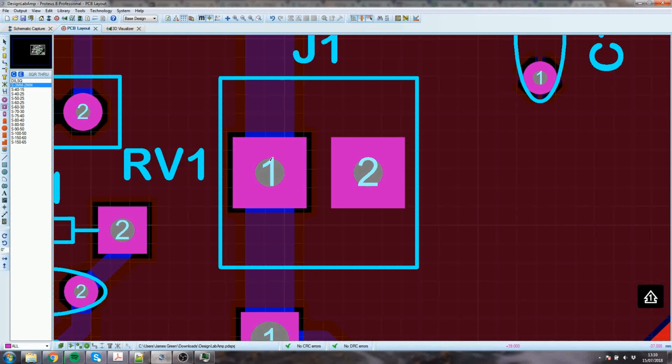When you get the board made, the through hole will be plated, and if you have to drill out that hole a bit to make it bigger, you have to be careful not to destroy all the through hole plating. If you do, then you need connections on both sides, which you don't here.